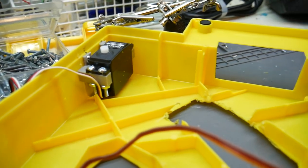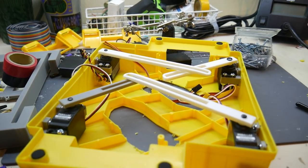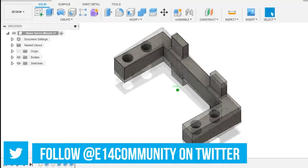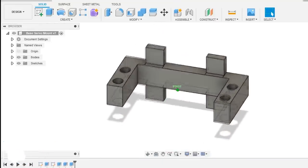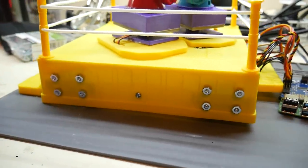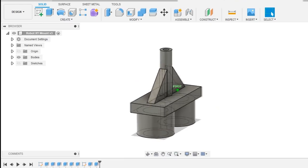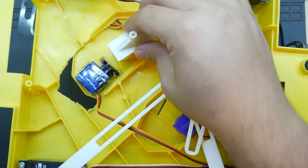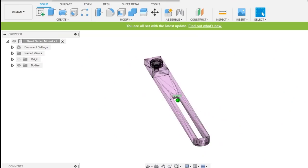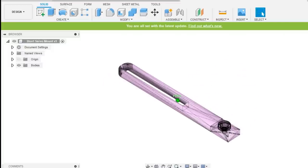For this project, I built just about everything into the plastic boxing arena. The X and Y movement in the base was pretty simple to make, but it required several parts. The first part I designed was a standard servo mount to hold the servos to the base on the side of the arena. I designed the pieces to hold four nuts and bolts, and drilled the holes into the mount. I then designed an extender piece that would attach where the controller used to connect, so the robots could reach the servos, intersecting the two servo pieces with a screw.